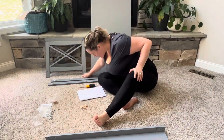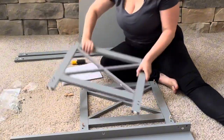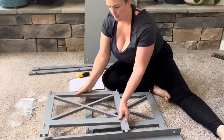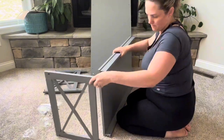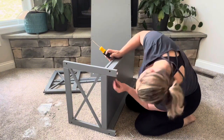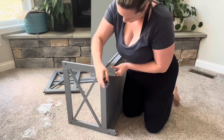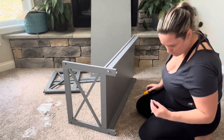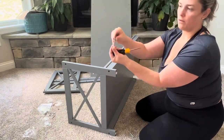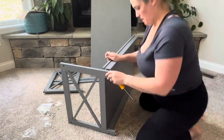Next, you'll need eight wooden dowels and the two end pieces with the X's on them. The legs are considered the bottom, so when looking at the holes, put the wooden dowels at the top of each set of holes. Find the piece with the X labeled three and insert the wooden dowel sticking up into the top circle of the bottom panel. For the lower hole on that narrow panel, insert one of the lock nuts into it, and from the outside of the left panel — labeled three, the one with the X — put one of the bolts in.